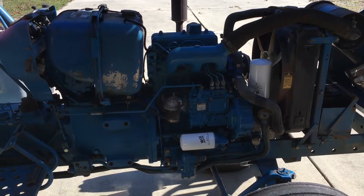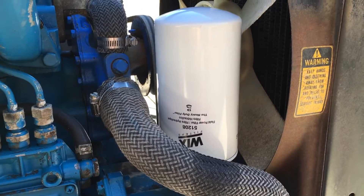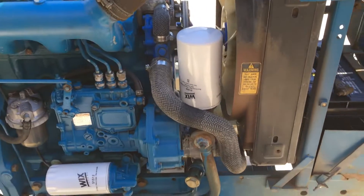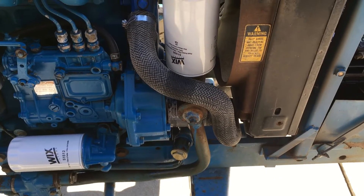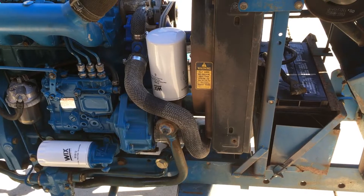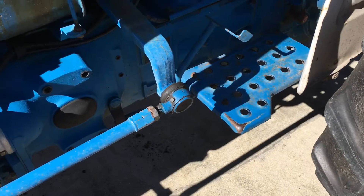After that I went ahead and drained the hydraulic fluid — it holds almost seven gallons, so it's quite a bit. The filter I've already replaced is the Wix number 51208. There are three drain locations. The manual calls for removing this plug right here to drain the fluid out of the filter first, but nothing really came out until I started opening up the bottom ports. Once I did get the old filter off there was still some fluid in there and a little bit went down the side of the tractor, but by that time I'd already drained probably five gallons out.